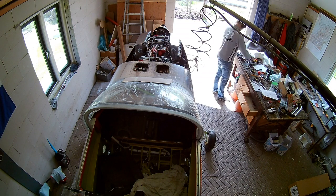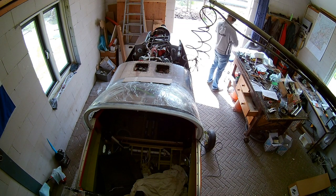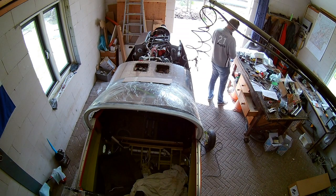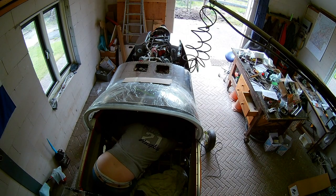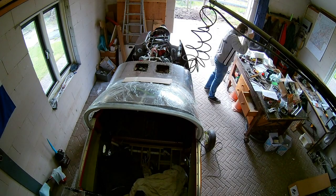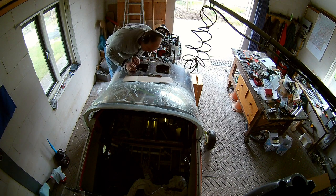The only thing which is a little bit worrying is that it's probably not very handy for maintenance. After 15 hours you have to replace the coarse and also the fine fuel filters, and probably then every 50 hours, I'm not sure, I have to check the manual, but at least you have to regularly replace them. Because I made such a very compact setup, it's not very easy to remove the fuel filters. So in hindsight, I could probably have made another setup which would increase maintainability. But hey, I do maintenance myself, so I'm the one who's having all the pain.